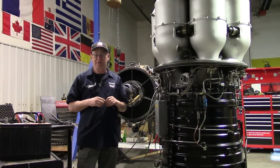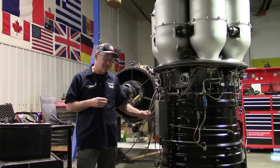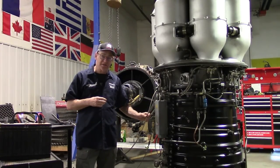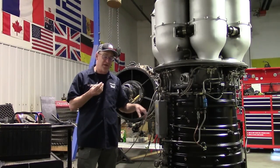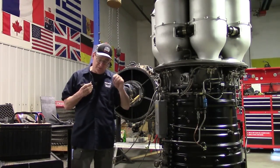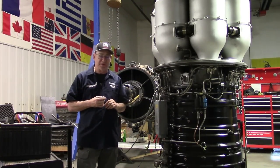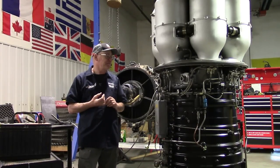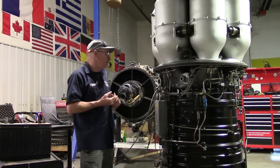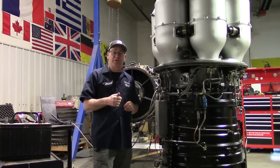You never want to get anywhere near them. The whole system is jacketed — the outer jacket of the ignition line is the ground, and they're stainless steel jacketed, Teflon lined with a steel core down the middle. I don't think they're R-type igniters, so you're probably going to get a lot of radio interference when this is going off.